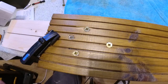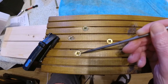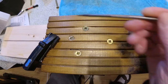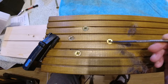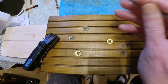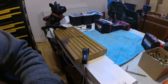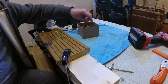First time I went in roughly the same place with the torque setting too high and it shot in — that was my fault. Turned it down to the first torque setting where it usually sits — actually quite impressed there. But look what happened when I went close to the edge — it just ripped it apart no problem at all. I'll move this to the side and show you me putting one or two in closer to the edge, not using the impact though.